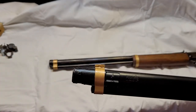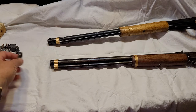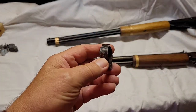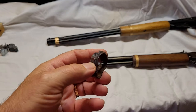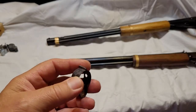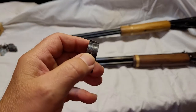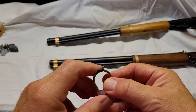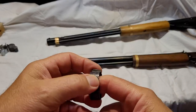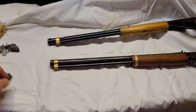Now, how do you make one of these? If you're really interested, let me show you a couple of things you can do. First, you're going to need to find out exactly what shape it has to be. It just so happens this is an old original band from one of the guns from back in the day — I drilled out the weld spots on this and removed it from a parts gun I had salvaged. I wanted to be able to reproduce one of these. This is made out of fairly stiff steel, so I wanted to work with something easier — I used 26-gauge sheet steel, which happened to be galvanized.